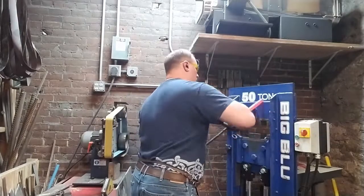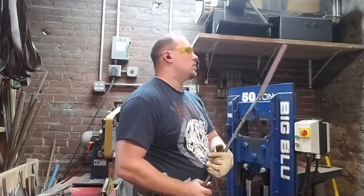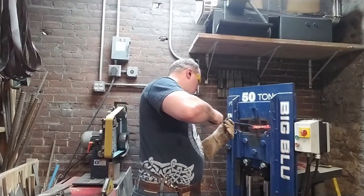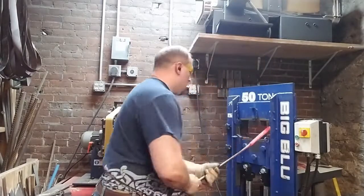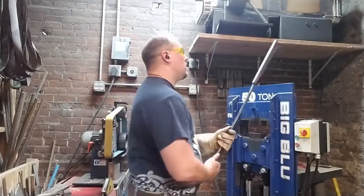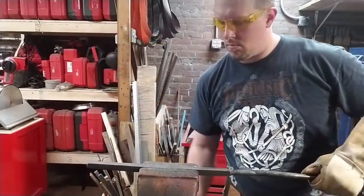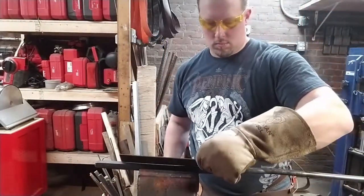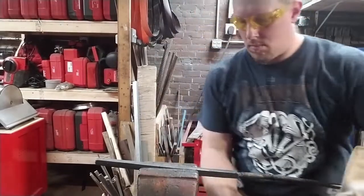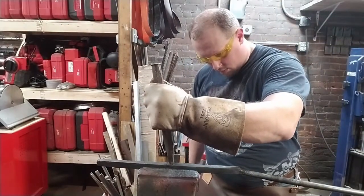But we think that the twist was probably initially a proof of good construction, a proof of high-quality material, because with laminated material, which all primitive iron and steel was, if the forge weld was conducted improperly, or if there was too much impurity inside the metal, then twisting would reveal those flaws and open up the seams. So bars that were sold with twists were essentially proof of quality, and then those bars could be welded up with the twists intact, and that would appear in the steel. And it doesn't take long for an interesting artifact to become artistic.